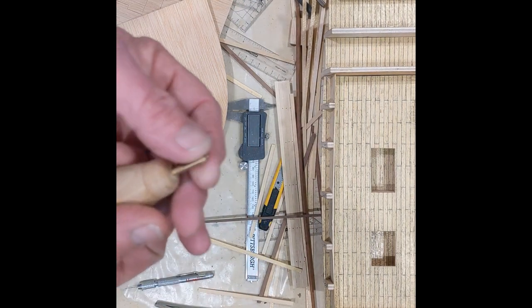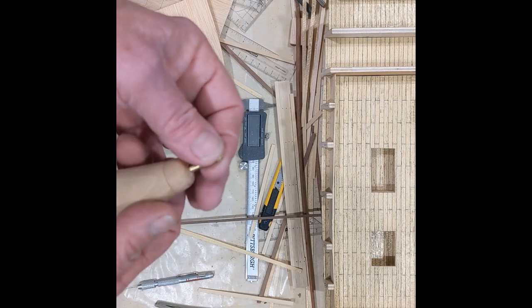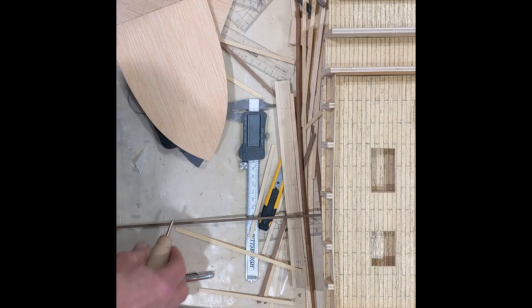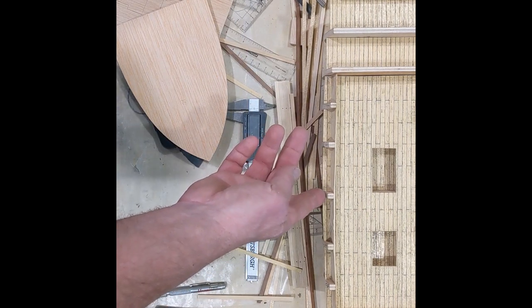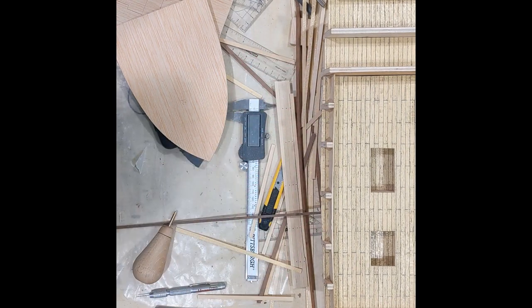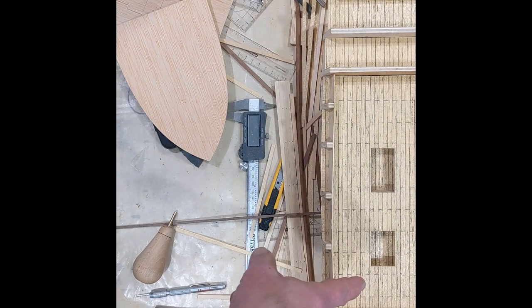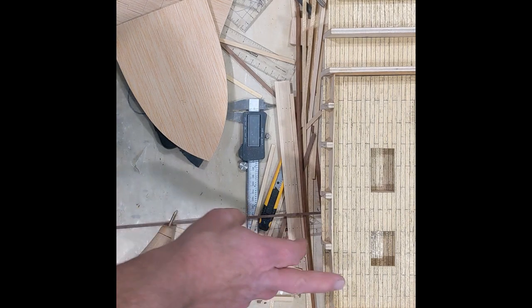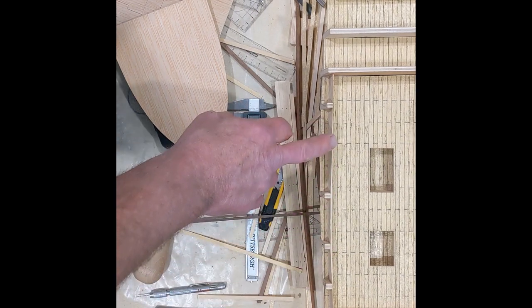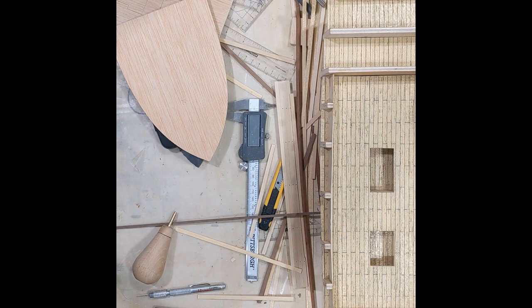Just basically, if you guys built one, all it is a little spring-loaded. Got a little magnet in there, which doesn't help on brass nails, and then you just pre-drill it, you push, and it goes in pretty easy. And you got to be careful on the edges right here because the nail goes through, so I'll have to sand all that down right there, grind it down, get those nail heads out of there. But let me go ahead and start pre-drilling my holes, get my nails put in, and then I will level these up here, get them glued on or tacked on, or whatever they were talking about, temporarily putting them in. And we will go from there. All right, I'll see you when I get all that done.